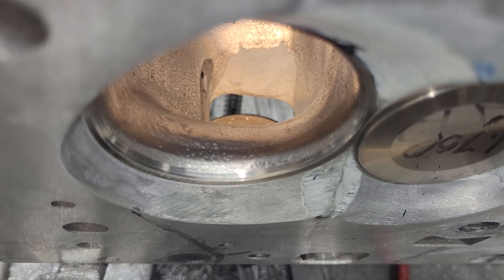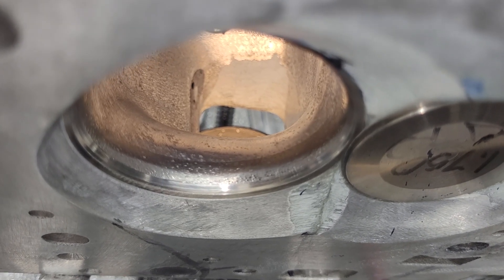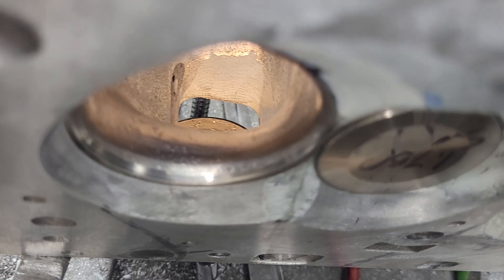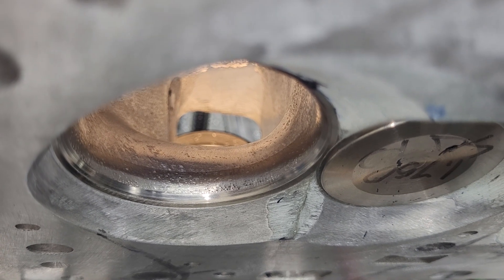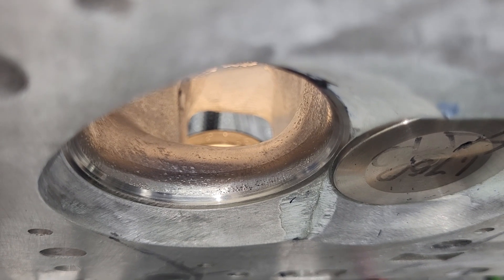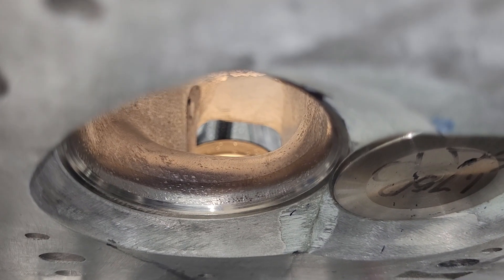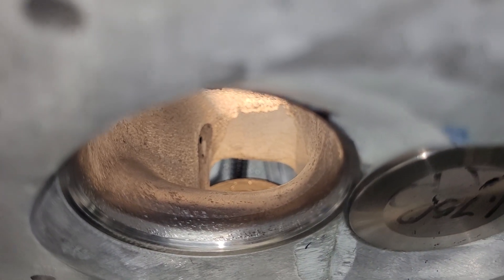The short side got a lot of work because that's where the air wants to go. As DV says, don't make the air go the way you think it needs to go — make it go the way it wants to go. How do you do that? You do it by air speeds. You figure out where it wants to go and you change it at that point. So the whole apex of that got changed slightly, the layback got changed, and I gave it some more area on both sides.